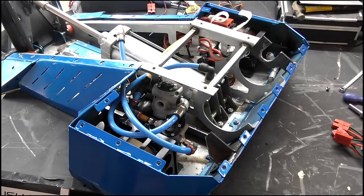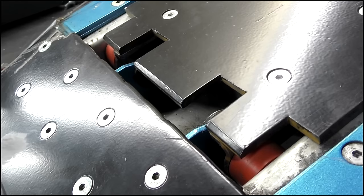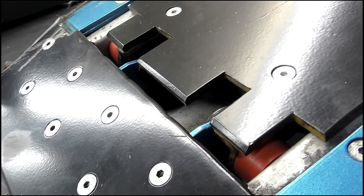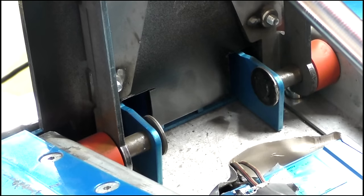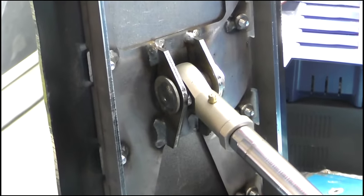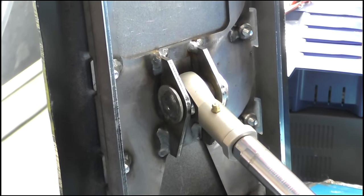Let's open it up and take a look at the inner workings of the robot. The black scoop at the front is made from 7mm thick titanium, protecting it from any damage. The front hinge of the flipping arm is held by two large pins attached at the base, while the arm itself is attached to the ram with a large pin, making it easy to remove for servicing the weapon.